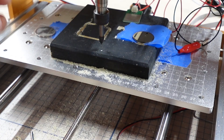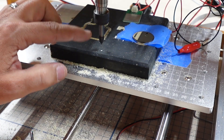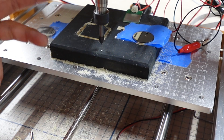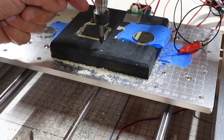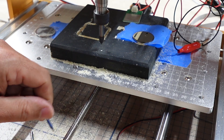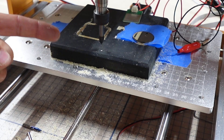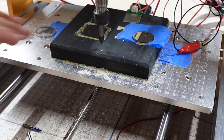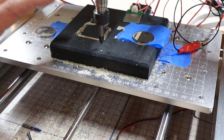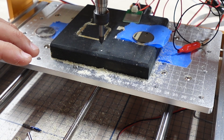My microphone wasn't on that whole time. So what I did was I put in a one-quarter inch bit - this is probably not the right bit for this job, but we're going to go ahead and send it. I went ahead and changed out because I kept breaking these little bits. So I put this V-bit in here and we should be able to cut this metal. I went ahead and probed it, got it all ready to go. We're ready to rock and roll - let's go ahead and hit send, spindle is on, let's carve it.